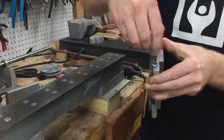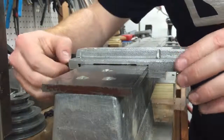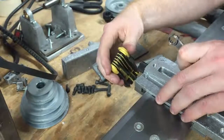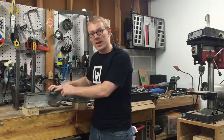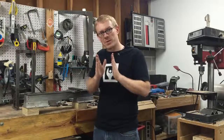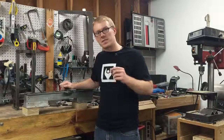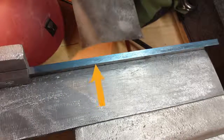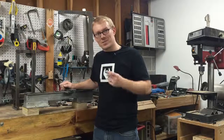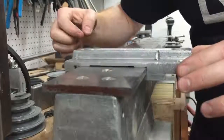Once the clamps are on the carriage base, you adjust the jib screws to get it to where it slides freely. It should slide with very little play over the portion where you mount it. You'll find it'll either be sloppy or tight on other portions because the bedways aren't perfectly parallel. I applied paint to the front of the bedways, and that allowed me to see a difference — where the paint is untouched versus where it's worn, which is where the bedways is too high and I had to scrape down that portion.